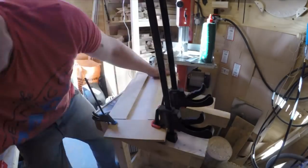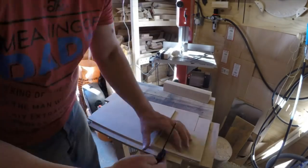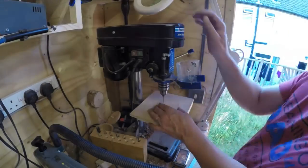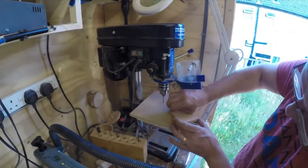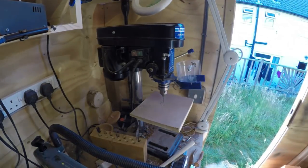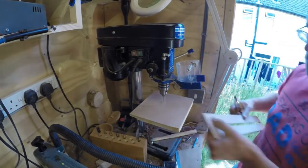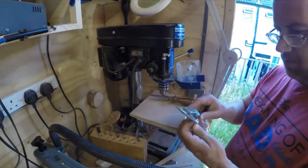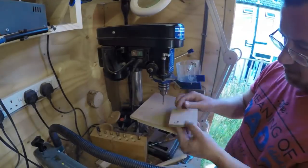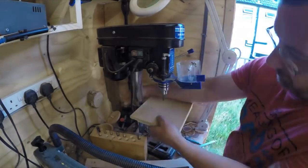Back to the main board work: the glue had dried and it was just a case of using PVA glue again to put the actual stopper block on. With all the pins made, I drilled a hole into a piece of waste wood first to test fit each one — I wanted a nice tight snug fit, so it was a case of drilling a slightly smaller hole and hammering them in, then pulling them out with a pair of pliers. I was actually drilling on the wrong side, so off camera I had to re-drill them all on the opposite side.